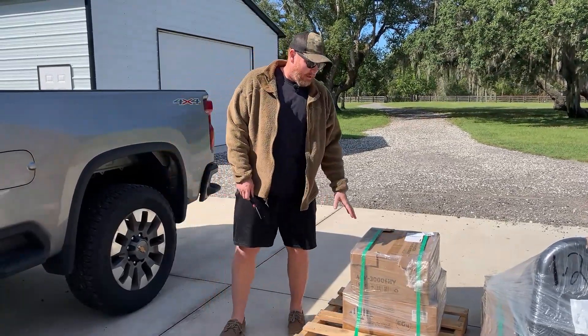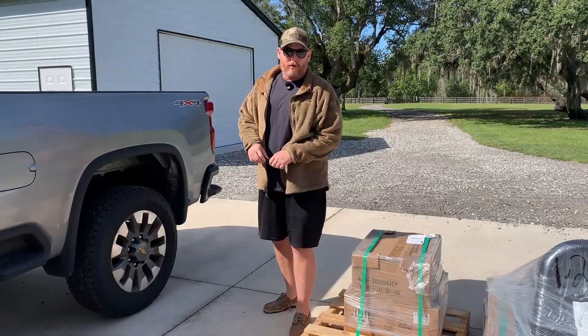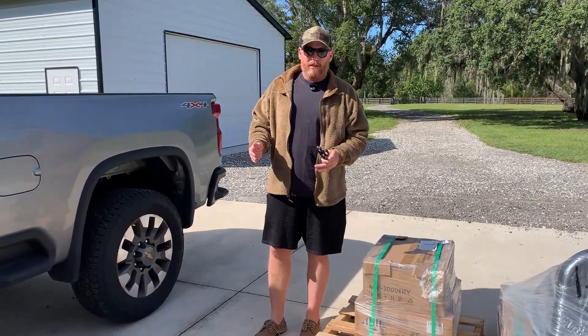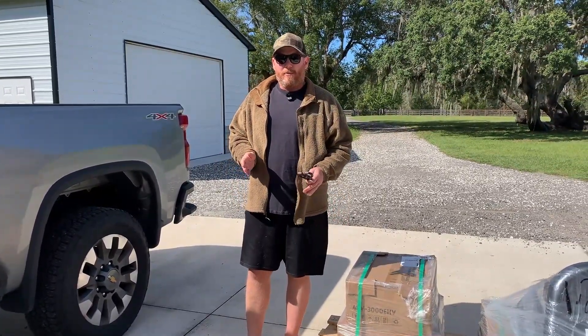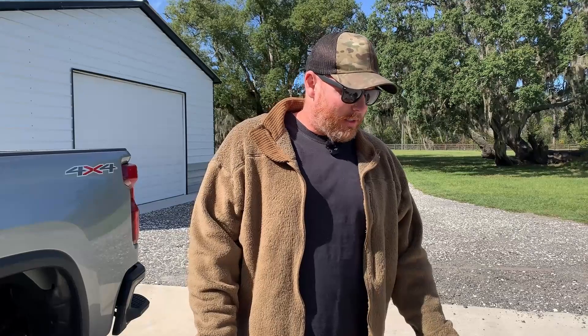The challenge is that I only have four solar panels at the shop, and to get all those in series is going to be weird because I have two facing east and two facing south. You want to have all your panels facing the same direction if you wire them in series, so I've got to figure that out. For now I can assemble it on the cart and use the existing station to charge it — not the most efficient since I'm losing conversion from DC to AC and back, but I don't use a lot of power in the shop right now anyway.